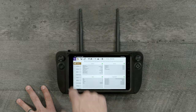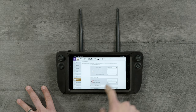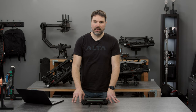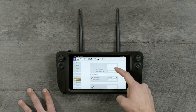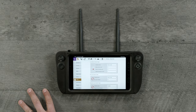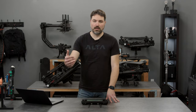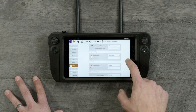If you go to the vehicle setup, which is the gear icon on the upper left-hand corner here, you want to go down to the safety tab, and then you want to double check that all of your fail-safe settings are appropriate for the mission at hand or the flight that you're about to make. Right here we can see that our fail-safe action for low battery is return mode, and we do currently have that programmed so that the default is going to be at 44 volts. So it gives you a little bit of juice to get home if you were on a longer range mission. But you may need to change that depending on what's appropriate for the distances you're flying — in this case it's showing 19%, so you just raise that a little bit if necessary.